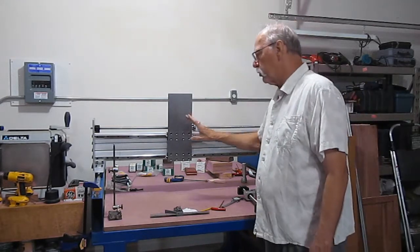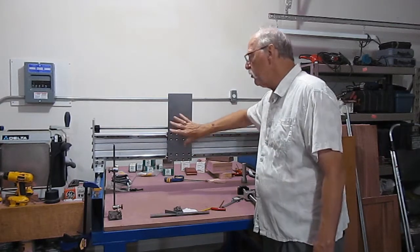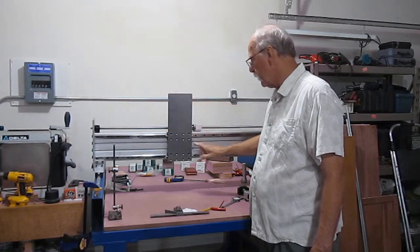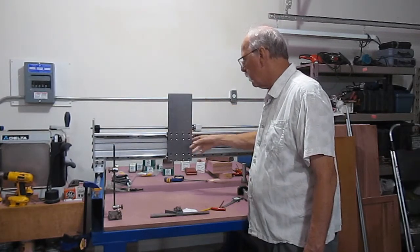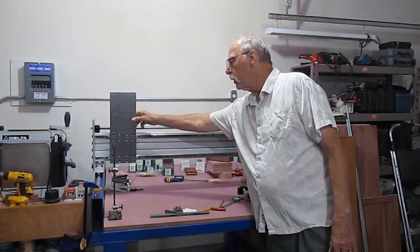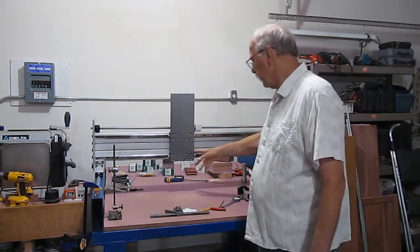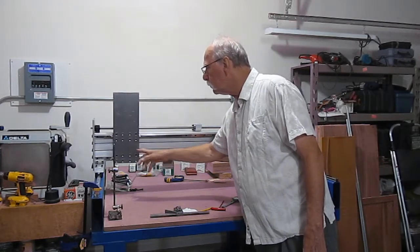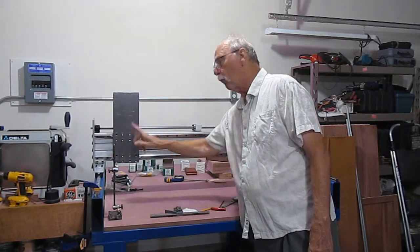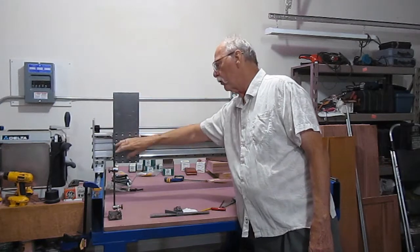But what you'll do is you'll run your bearings, and you need your bearings affixed to your Z-axis mounting plate to do this. What you want to do is, first of all, remember these rails were loose. Affix your mounting plate to align the bearings. Come along, snug up the top and the bottom, one end. A couple, 3 places, a single place, you don't have to do everything.